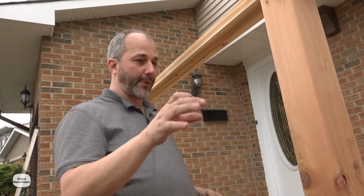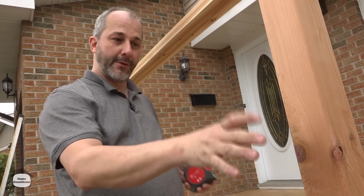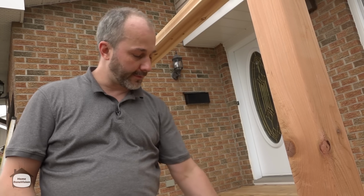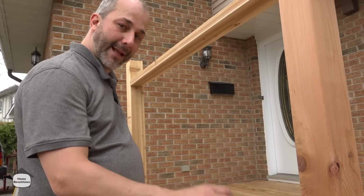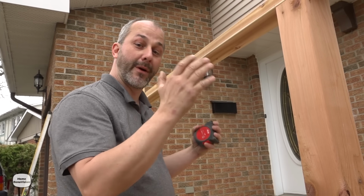We're going to do the same process all the way around the deck, measure from the base to the base, and then cut 2 for each section. And then we'll assemble it all and then stick them in place and mount it with the screws. It's that simple. There's not a lot of brain work involved here. Just make sure that you're measuring the base and that's the number you go with no matter what. And everything else will tighten up and close square and plumb.